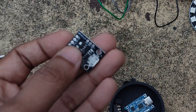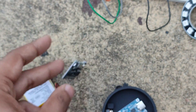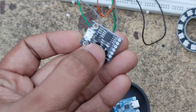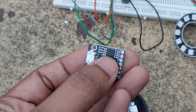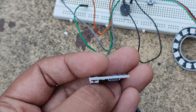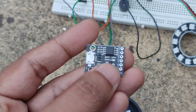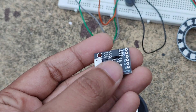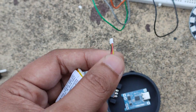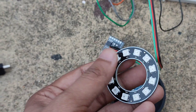The problem is that this board actually works on 5V, so I have to boost the voltage from the battery. What I will do is remove the ATtiny85 microcontroller from the DigiSpark board, erase all the memory and bootloader already in it, and reflash it at internal 8 MHz. After this, it will work on 3.3V, which I will supply from an LDO. The battery will be connected to a 3.3V LDO, and the 3.3V will go into the chip and also into the LED ring.